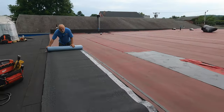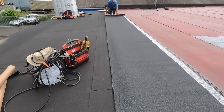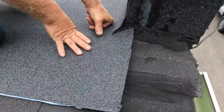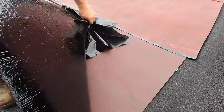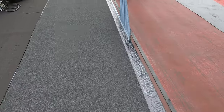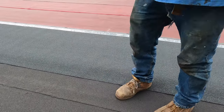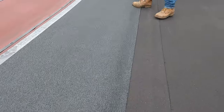I'm going to line it up just like that, cut the corner so it doesn't stand up, place it down flat. Then you remove your plastic base. You remove the plastic from the cap sheet. Here's the thing — if this is a hot day, this cap sheet will stick to the other torch down here. So you really don't have to do anything extra.